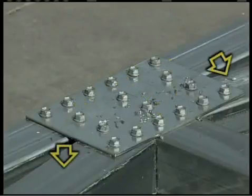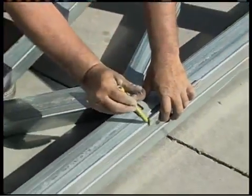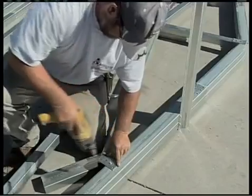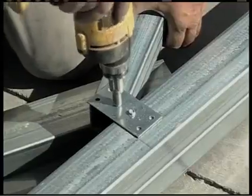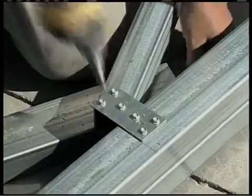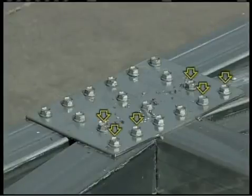The two diagonal brace pieces are now centered on each rafter, with the other end abutting where the center brace meets the collar tie assembly. Use the BK-20 flat brackets to affix to the middle of the rafters, and slip the other ends into the 4-inch by 6-inch flat bracket on the collar tie assembly, and secure them with frame screws.